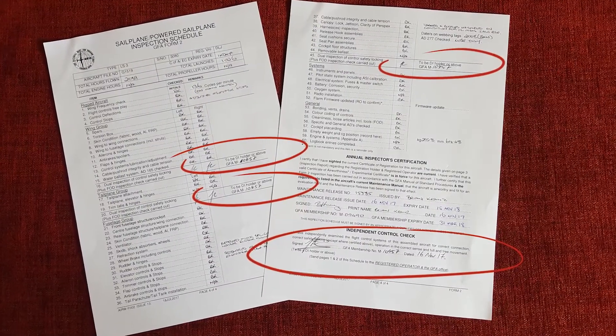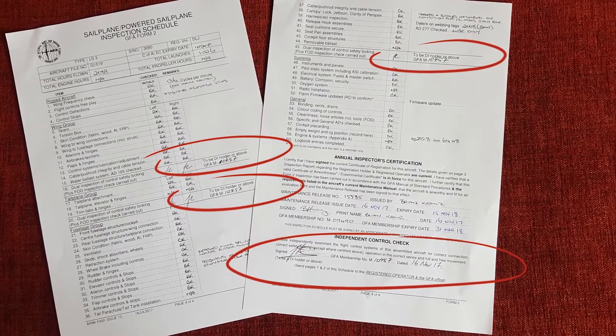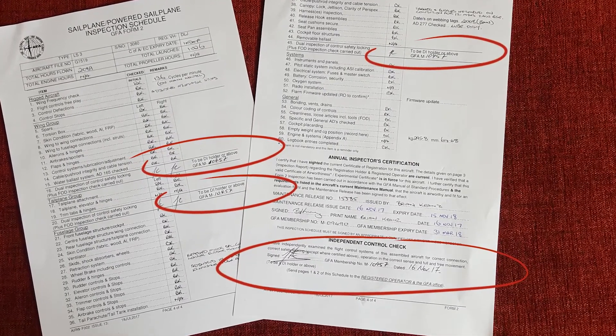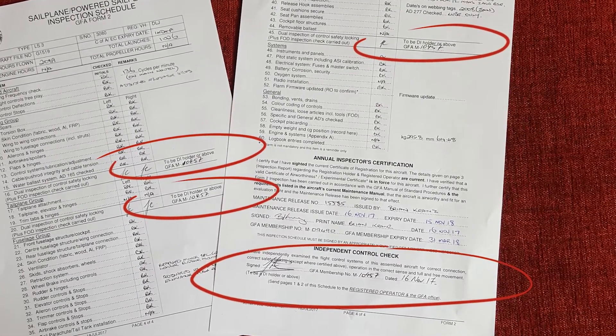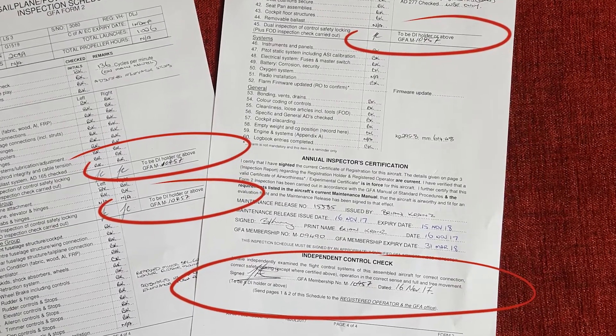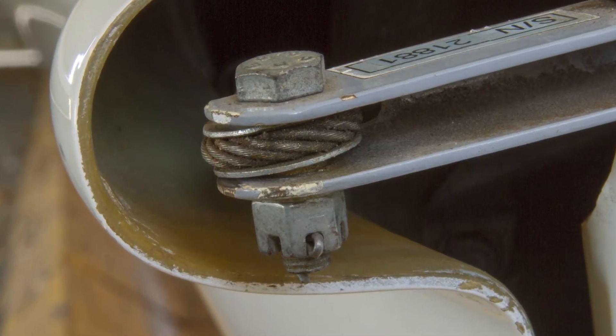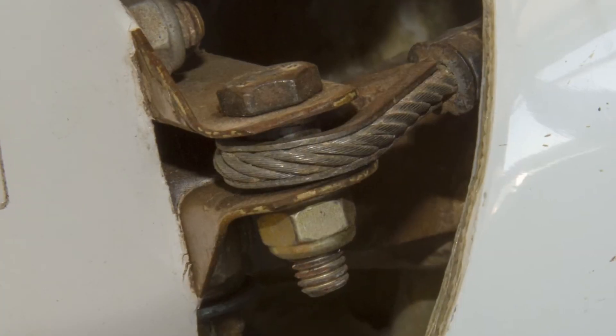Several parts of the annual inspection paperwork require a second check of the inspector's work to ensure the aircraft has been correctly reassembled. Here you use your experience to double check the work of someone else. Caution and an extra dose of scepticism are your ally here to ensure that the aircraft is safe to fly. In your check, you should look at all the nuts and bolts, pushrods and cables, ensuring that they have been correctly secured.